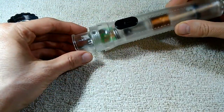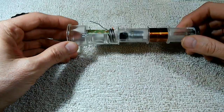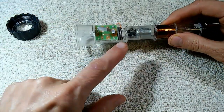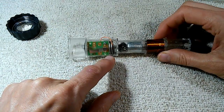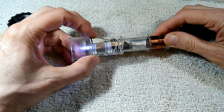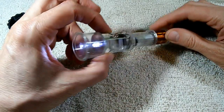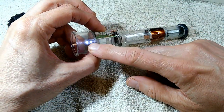If we shake out the contents, here's what we get. I was quite surprised — what I discovered are two coin batteries, and they are three volts apiece. There's no circuitry here at all except for a switch. When you press the button on the flashlight it closes this contact and directs the power from these batteries to this LED light.